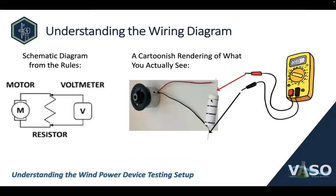Now, all these component pieces — understanding the wiring diagram. On the left is the schematic that's in the rules, which can be a little confusing if you're not used to looking at a circuit schematic. We have a cartoonish view of what that looks like: the motor with the spindle wheel attached, then the leads coming out of it go to the resistor, and the multimeter also connects to the resistor. It's important to recognize that when you attach all these components together, don't glue them. Glue is an insulator, so you'll want to solder or twist them together or use some other method — glue is a bad method of attaching anything.